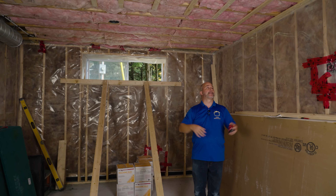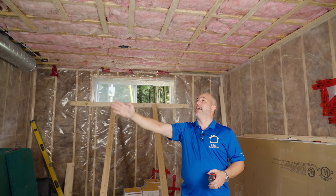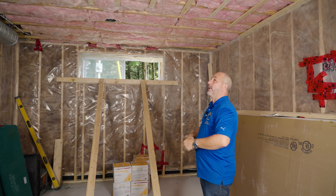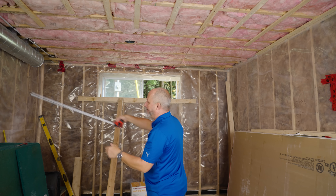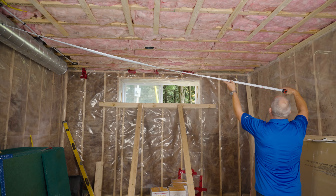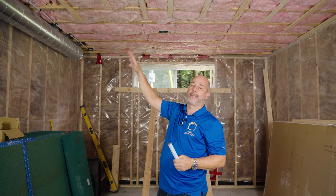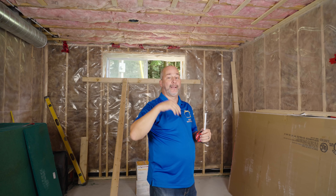So what I do is walk through the room. Here's my ceiling — it's strapped, and I always strap my ceilings because it makes installing drywall so much easier. This particular ceiling has engineered floor joists going one way, then a double LVL, and then the joists change direction. By strapping, you get rid of all that confusion and end up with a straight installation. I want a sheet that goes from one side to the other with no joints — no butt joints in the ceiling. I throw my tape across the ducting, come across, and I'm at 12 feet. If I had 13 feet, I'd build out a soffit so I'm left with a perfect 12 foot. That's how I order drywall — keep it simple. If you can build to the dimensions drywall comes in, it saves you time and money on installation and taping.